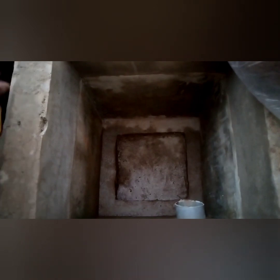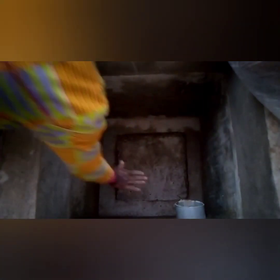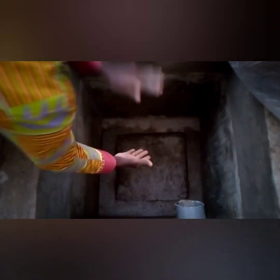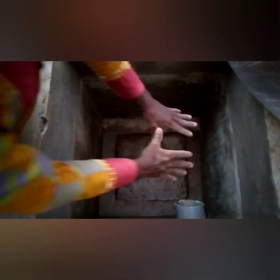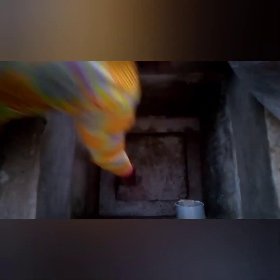If you want to install your digester, the first thing you do — as you can see the way you have laid the blocks — the first block you laid, you make it flat. You don't need to put it on edge like this. That one is flat, and the next blocks you laid after that are on edge, so that you can have an installing seat as you can see here.